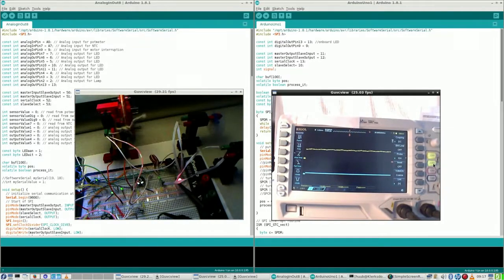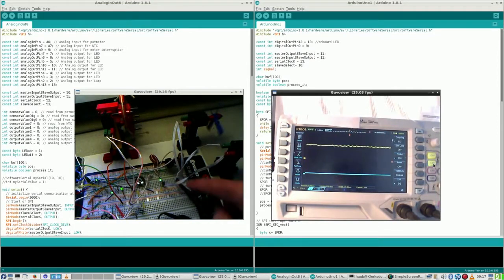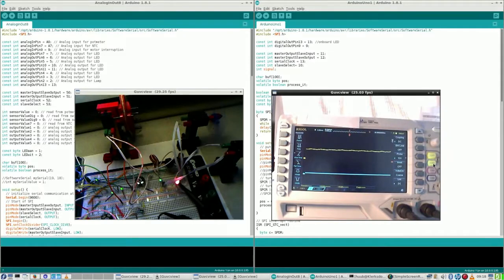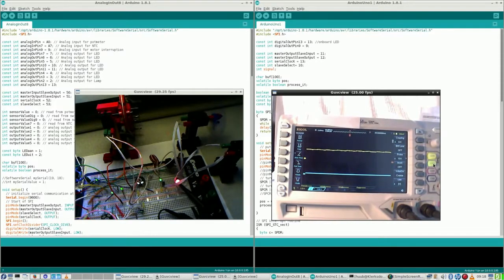And this, and alright, yes, and it runs again, but this shows that I have to be really careful with the signals that I probe, because the transistors don't have very long wires. So what I actually should do is put some wire next to the transistor in the same lane, so I can safely hook up. And I should actually do the same right in this circuit.